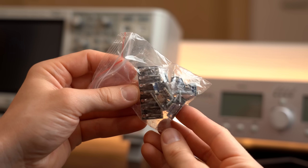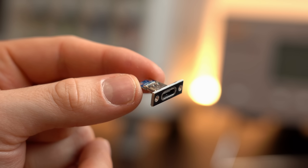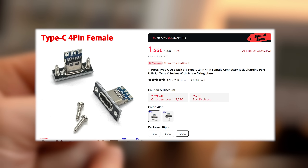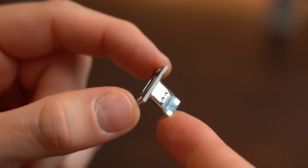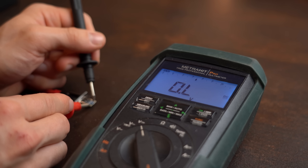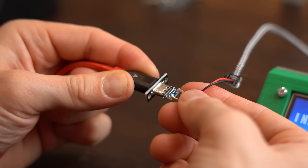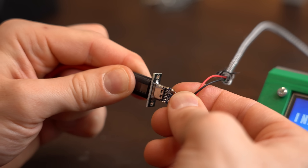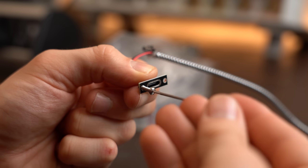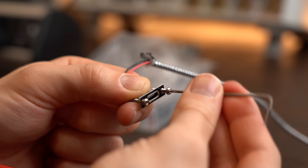Moving on to a product that is maybe not that spectacular, but for me as a maker, these USB-C connectors that you can get 10 pieces of for €1.56 just looked amazing. You get a USB-C socket into which you can plug your USB-C cable and then get 5V output to power your projects. The little details here — the socket is well bonded to the mounting PCB, you can use M2.5 screws to attach it to a housing, and the product description offers mechanical dimensions — makes it super useful to me.